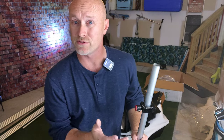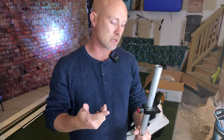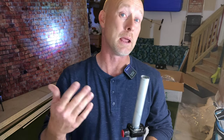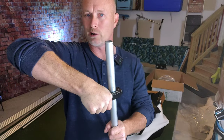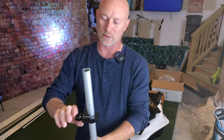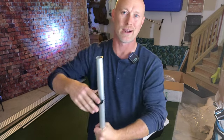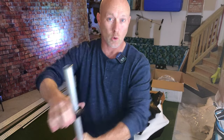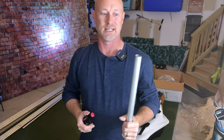Now I thought I'd show you how easy this is. There are a lot of different options to cut these pipes. Like I said, at the store when you purchase them, some stores will cut them for you. If they will not, you can use a compound miter saw with a fiber blade, a grinder with a fiber blade, a hacksaw and a miter box, or a pipe cutter. Now this is not the heaviest-duty pipe cutter in the world — you should probably use one that's a little more heavy-duty than this. But this is the one I have. So I just crank down on it a little bit, get it tight, and then you spin it around. When you first start spinning it after you tighten it down, it gives you a little resistance, but then it starts to loosen up. I have to crank down about five times and spin it around two or three times with each crank. Eventually the end of the pipe comes off.